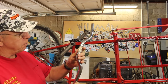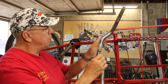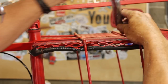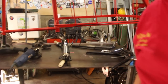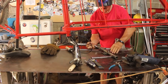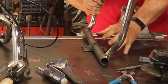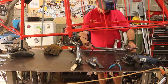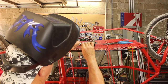I think I'm going to use these handlebars for the feet of my kickstand because I like the shape. I'm going to cut these up and make a little pivot. I put these stops on here to locate the kickstand in between, and now we need to put a spring on it so it'll stay up. Let's see if I nail the spring down here - yeah, I think that will work.